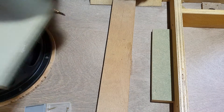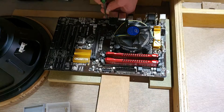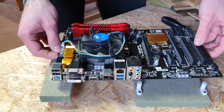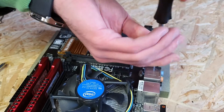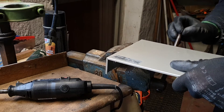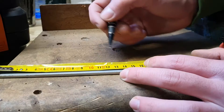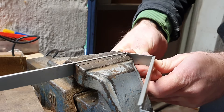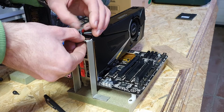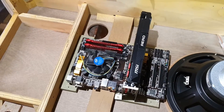The core of the build will be the PC. I won't use an entire case as that takes up too much space, so I'll make a custom base for it. Because there's a cross beam in the spot I want to put the PC, I made two separate MDF boards to go on either side. I put the motherboard on top and screwed the standoffs into the bases, then removed the motherboard to screw in the final plastic pieces in their marked spots. The GPU will need some extra support, so I grab a leftover piece of metal and cut out a long strip with my Dremel tool, then bend it into a U-shape bracket. I drill mounting holes so the GPU can be bolted to the bracket, which can then be screwed down into the wood. The entire thing gives me a nice, solid base for the PC that can withstand shaking the cabinet.